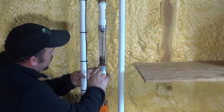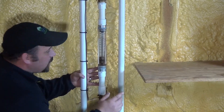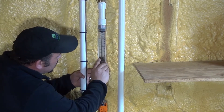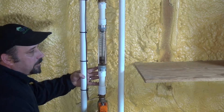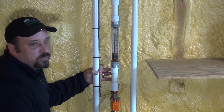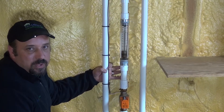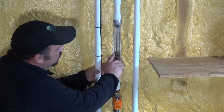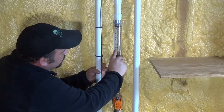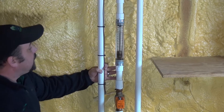On this one, for a four-ton system, you'd want to set this just above where it says one — around 1.2 gallons per minute. Let's say you had a 10-ton system: your total flow rate for geothermal would be 30 gallons per minute, and ten percent of that would be three gallons per minute. So you would want the float set at three — right here — and that's how much you should allow for bleed rate.